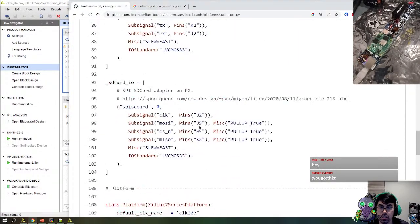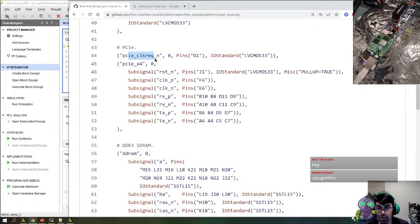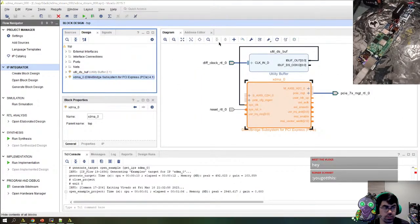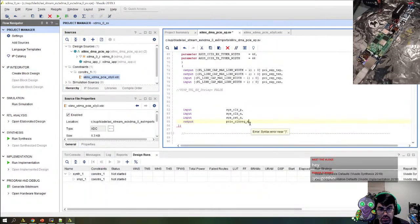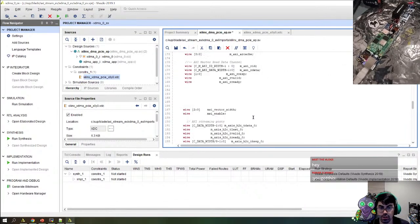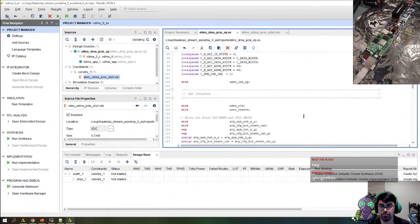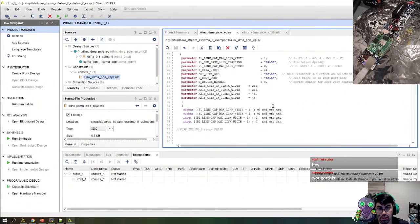Here, if we go here, in the PCIe section, there is a clock request. So let's go ahead and do a clock reset, our clock reset here. So we're going to call that PCIe clock. And where's like the first assigns? Here we have system, and we can just do a very simple assign zero, right? Zero. Okay. So now we're going to run synthesis, and then actually no.